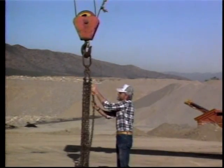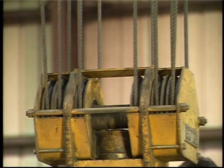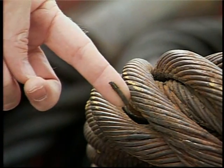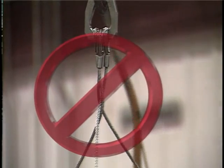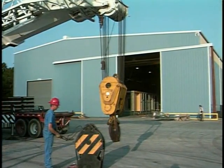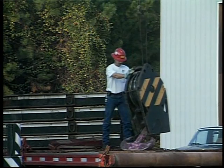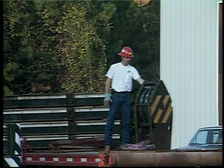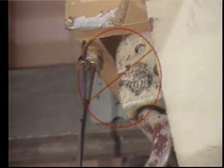This program is almost over, but there are some special considerations to review regarding wire rope and cranes. If you notice broken or damaged strands in your wire rope, have your foreman or maintenance person check it out immediately — it's dangerous to take chances. The most damaging thing you can do to wire rope is allow it to kink or twist. Your crane hook is quite heavy and designed to keep enough tension on the wire rope to prevent twisting and kinking. Problems occur when the hook is allowed to rest on the floor, causing slack that can kink the wire rope. Another safety rule: never run the hoist or crane all the way up or all the way down.